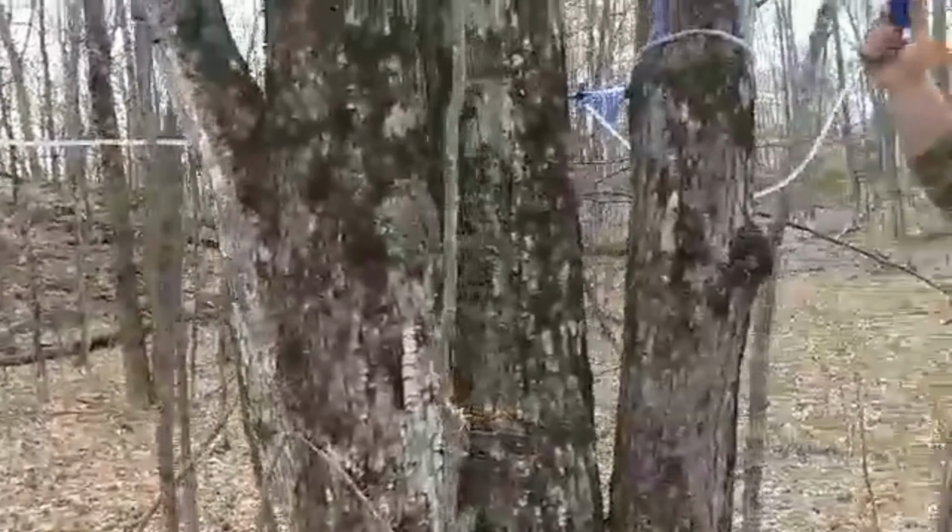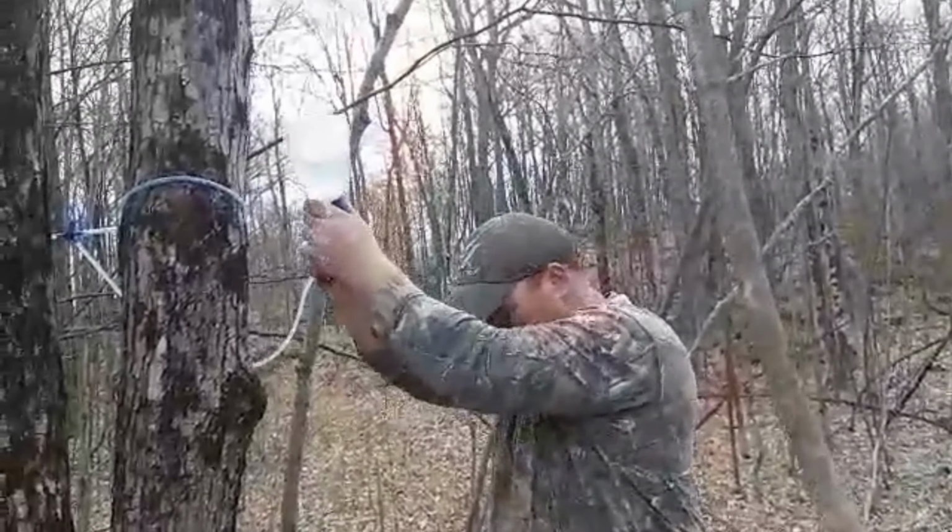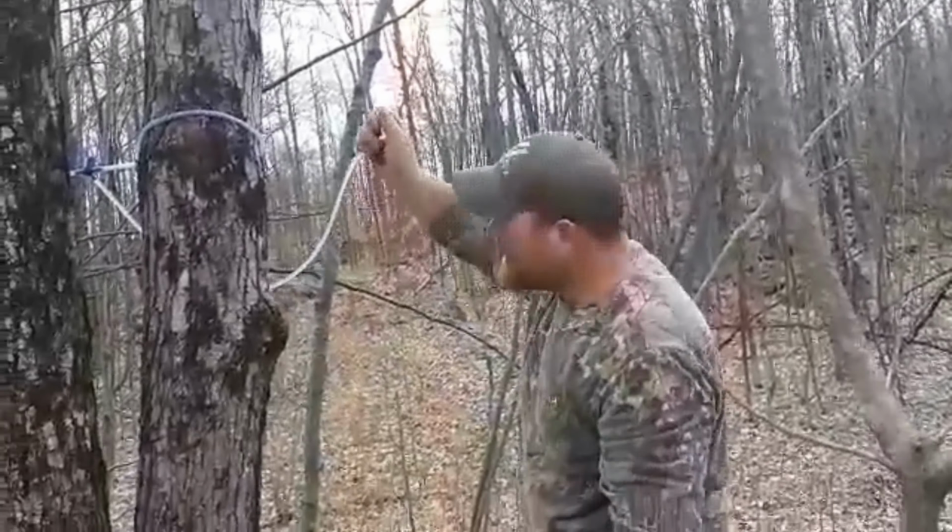So that's probably enough water. Just hold it up. You can see it driving through. It's pulling it through, the 3/16 pulling it through. And I just take the end. This is the end drop, and I just leave it tucked in here, so it actually can get air. So when I spray all the drops, it actually pulls through faster. And then when everything's done, I come back and I will plug it back in, so everything's airtight, so the isopropyl stays in there, no bacteria grows in the lines, and then it's good for next year.